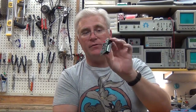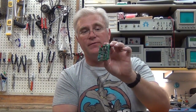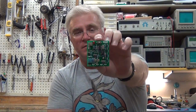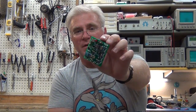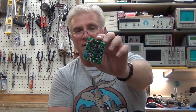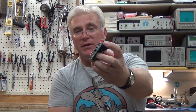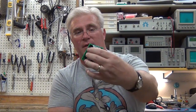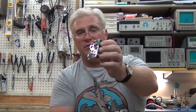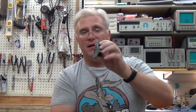It makes sure that your voltage meter has got good resistance readings. It's got really high accuracy resistors, a voltage reference, current reference, and frequency reference. You can take this board and make sure your equipment is fairly close to spec — it's like a poor man's calibration tool. You could use these in a school or college, or just spot check your equipment.